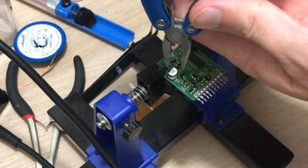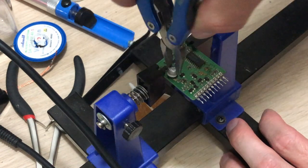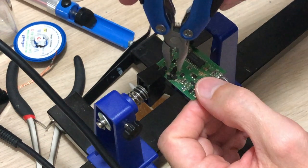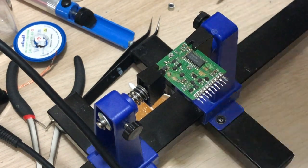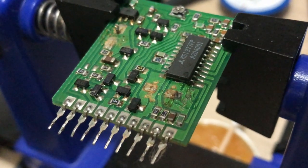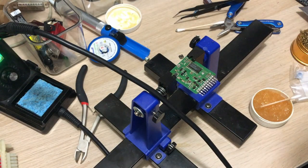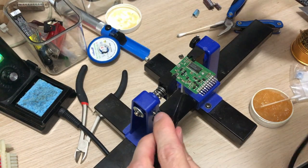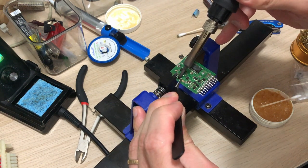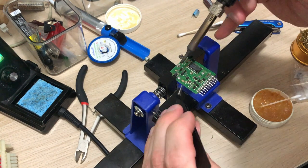I don't have a hot air gun and the soldering iron does little to remove surface mount caps in my experience, so I'm going to use some pliers and just wriggle them until they come loose — but you want to be gentle, because if the pads are corroded and damaged by capacitor juice they might lift and then you're in trouble. I'm removing the legs from the surface mount caps with my soldering iron and tweezers, then putting some more flux and solder braid to remove any leftover solder, and of course cleaning with isopropyl alcohol.